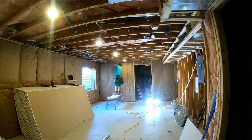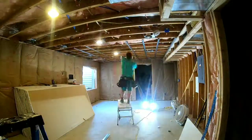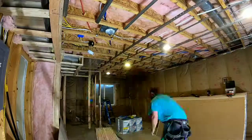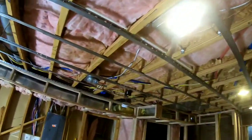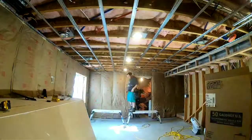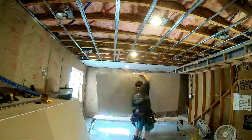RC channel is going up. It does a fantastic job with reducing vibrations for noise reduction. It's really good and pretty cheap. You want to do 16 on center for the ceiling — that is best practice. You can also hang RC channel on the walls; however, this was a basement and basically all the walls were exterior, so it would have been just a waste of time and money.